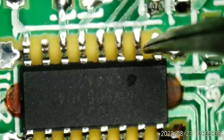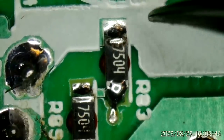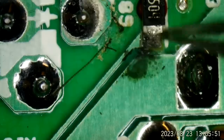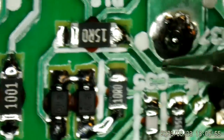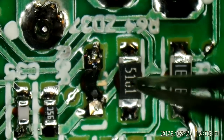So this is normally monitoring 400 volts, not directly, through a divider right up here. Normally you'd have like 395 volts when it's running through here, through this resistor. That's where somebody, a roach, has stepped in there. Comes through here, runs around through here. And as you can see, it splits right here. Let's look at this path though.